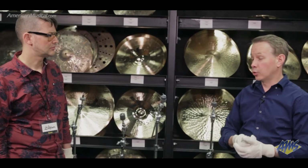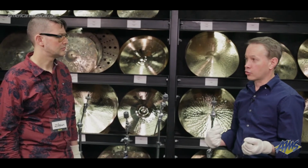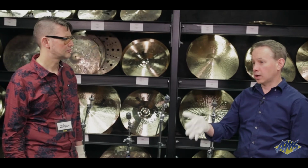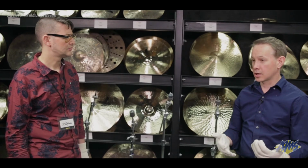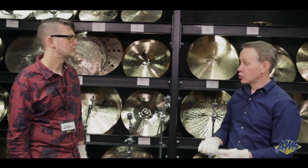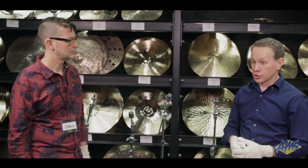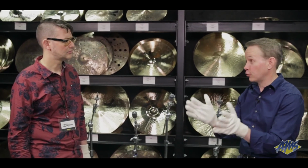And then we came out with the Choral some years ago, and that really harkened back to the manufacturing over in Turkey when Zildjian was doing stuff with the sledgehammers. So the Choral cups and all the cymbals start off very, very shallow, and then after they come out of the tempering tank, we reshape every single cup to a new shape with a hammer, so every single cup is different. That lends itself to a very individualistic Choral. There's a Choral sound, but it's not identical, so it wouldn't be as tight as an A or an A Custom.